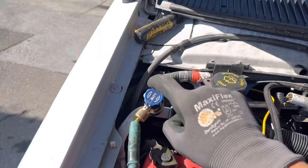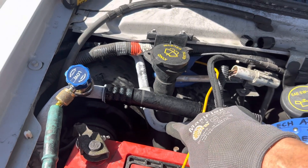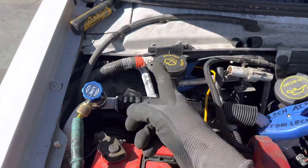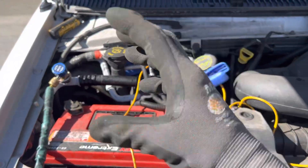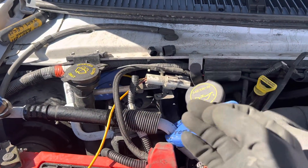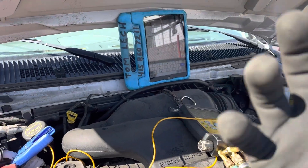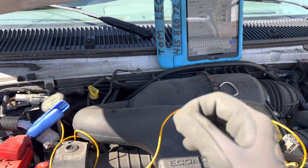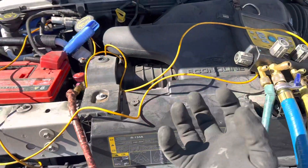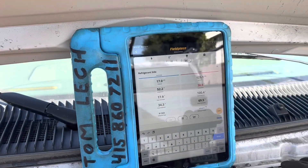My pressure and temperature here are not the same as at a service port on the other side — they'd be different, but they're both on the suction line returning. Every time you go through a bend, a restriction, a muffler, anything — it adds restriction to the flow of a fluid. And yes, air is a fluid, gas is a fluid, everything is a fluid. You have to get out of the mental blockage of thinking of fluids as something solid like water in your hand. When you get into fluid dynamics, you'll understand that.